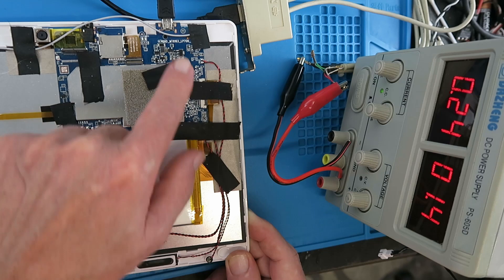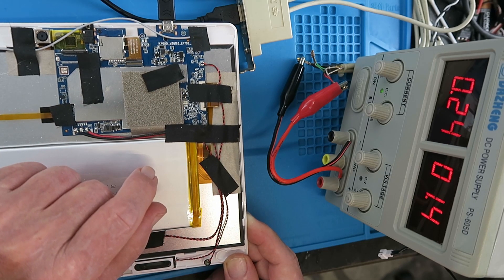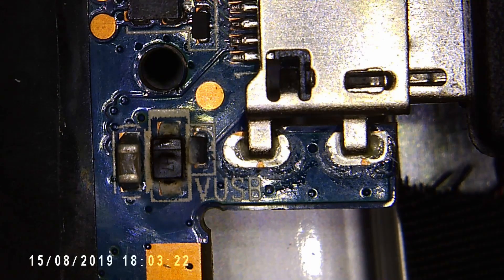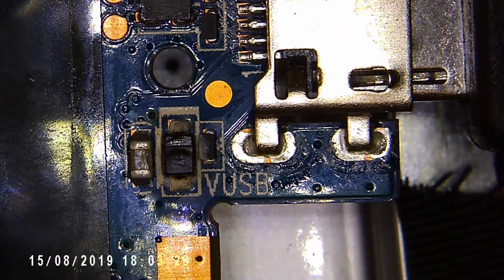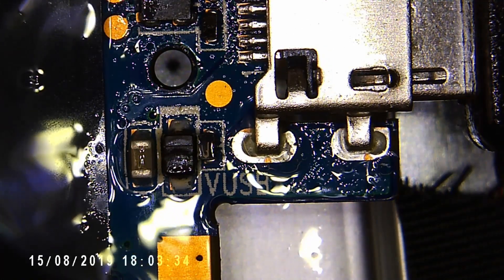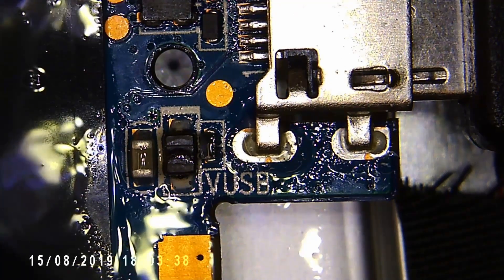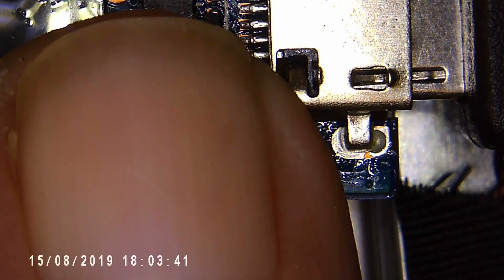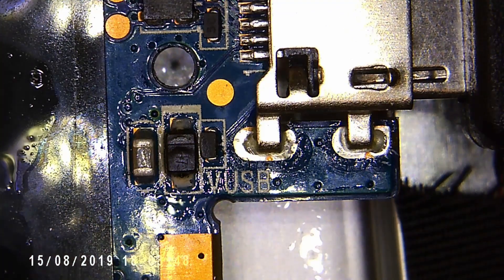So something around probably this area is going to be getting hot. Let's get in a bit closer and see if we can see what's getting hot. On turning the board over we can see here a component that would appear to certainly have been overheating. If we squirt a little IPA isopropanol on it we can clearly see that it is boiling away there quite fast, so clearly it is getting hot. And finally an inspection with the mark one temperature sensor confirms that yes indeed this is the faulty component.